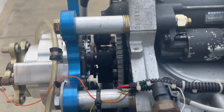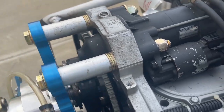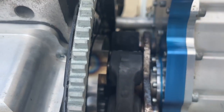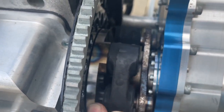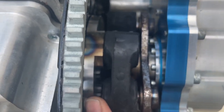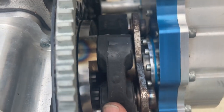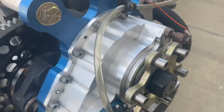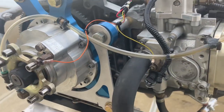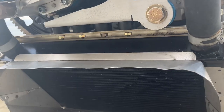Use 3 washers in addition to the existing spacers so that the end result is a setup where the bushings or drive couplings can move back and forth about 100 thousandths, like that. Torque everything down to the engine. Make sure if you have one of these pieces that goes on as well, that holds the radiator on this setup.